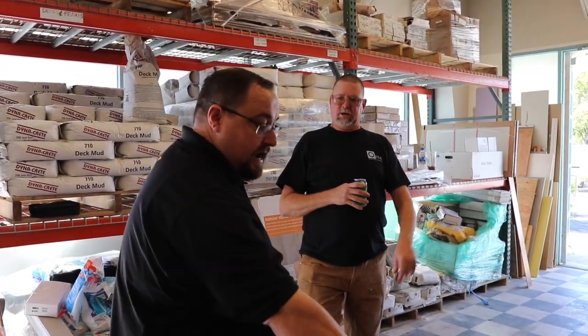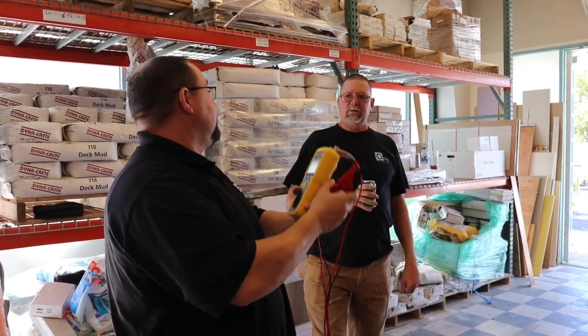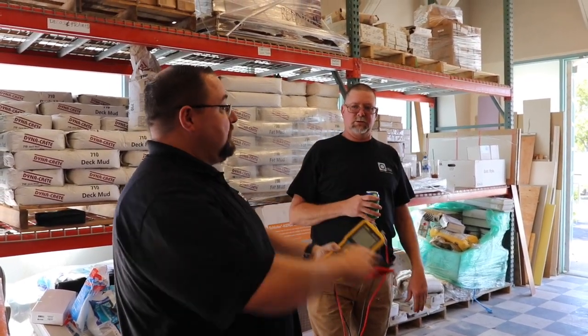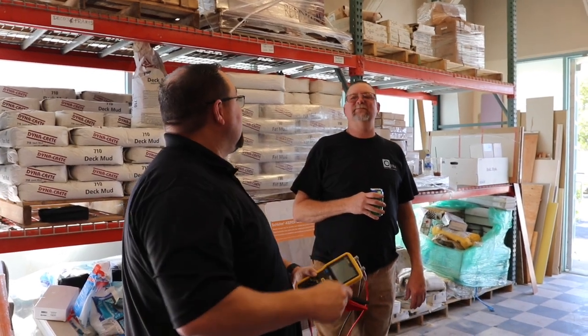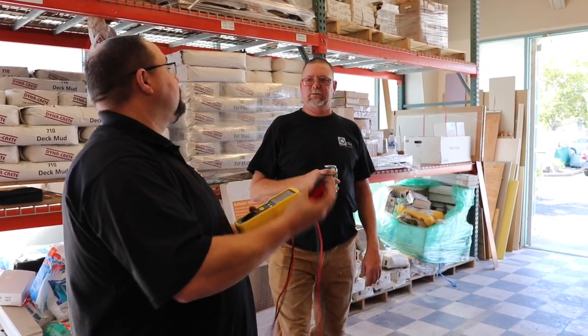We say you do that test three different times. You do it when you buy the wire — right now, before you un-spool it, before you unwrap it. Just pull that end out and test it — all three tests. Because once you un-spool it, it's yours. So if it's bad at that point and it's our fault, it's still yours. So you just pull those ends out and do your first round of testing, and you do those three tests.